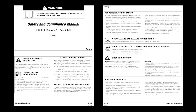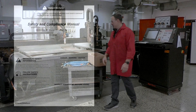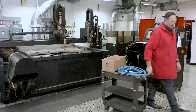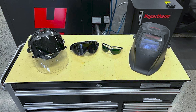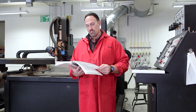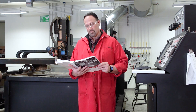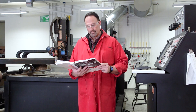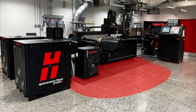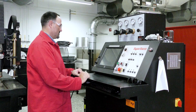Here are some safety precaution guidelines that should be followed prior to startup. Before starting the cutting process, verify that no obstacles or personnel are near the cutting system. Obtain the proper shaded eye protection for the cutting process being performed. Please review the safety section of the manual provided with your cutting system for proper eye protection requirements. And verify that there are no flammable substances near or around the cutting area before you begin.